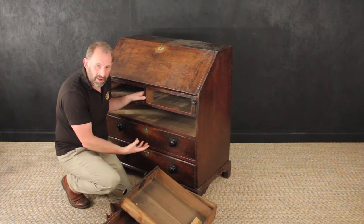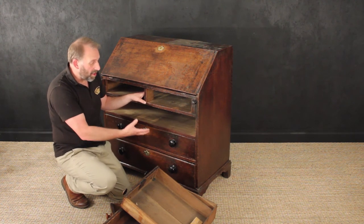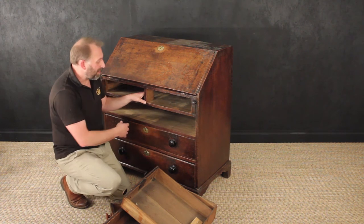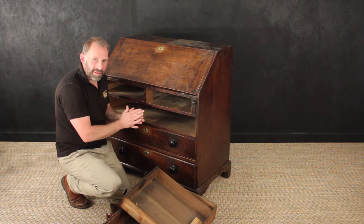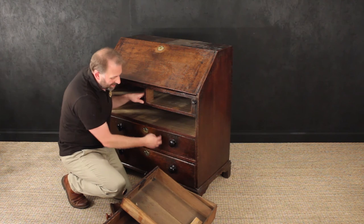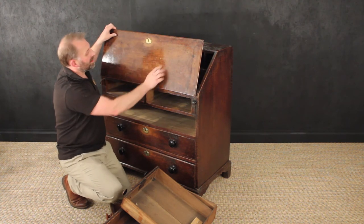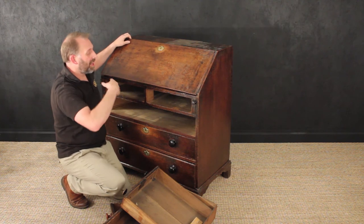It's not naturally this oak color — this is not a Jacobean oak, not a 17th or 16th century oak color coming through. This darkness is applied varnish, like a shellac that the Victorians would apply to pieces of furniture to revive the finish. But every time it was applied it got darker and darker, so it's acted almost like a paint — it's quite opaque and is obliterating the actual timber. You can see this lovely oak underneath, and we're looking to get back to this honey oak color, which we will hand polish and wax finish.